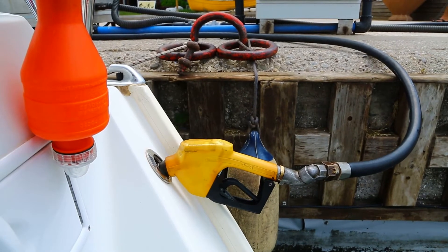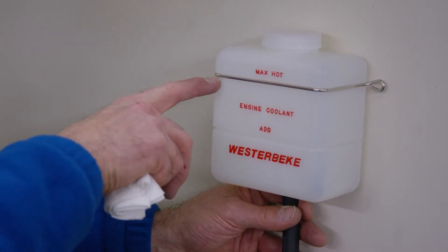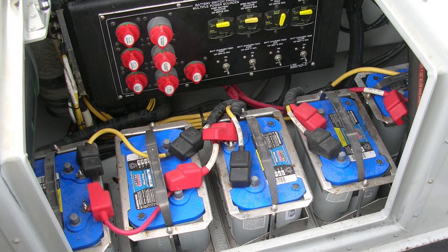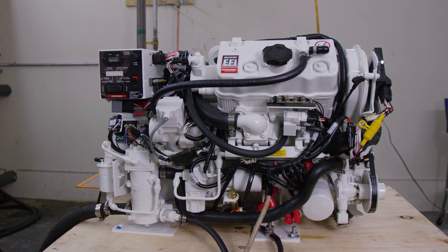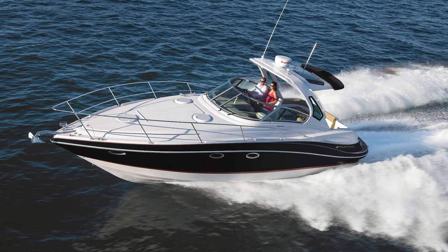It's important to also check the fuel supply, the DC electrical systems, the battery, and the coolant to ensure every part is in proper working order. The generator starting battery should be either turned off or trickle charged whenever away from the boat. A battery rated as suggested in the operator manual specifications must be used. A dedicated and isolated battery is best. The battery should be clean, dry, and fully charged to a static voltage of approximately 12.8 volts DC or better. The terminals on the battery and connections to the generator must be free of corrosion to ensure good connections for the best possible performance.